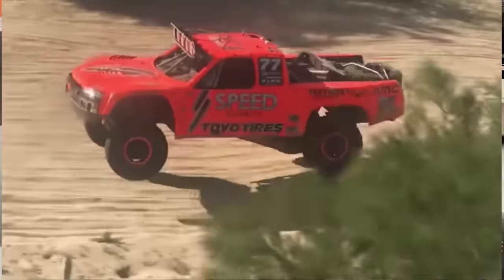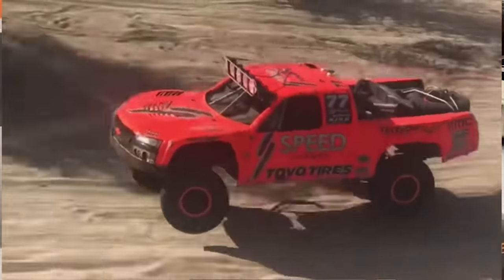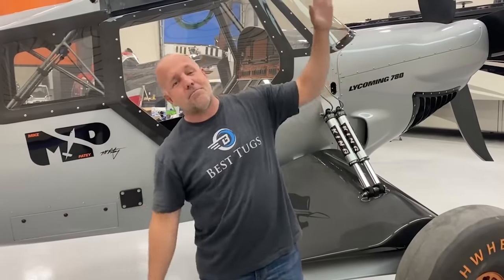On 20 inches of travel, there's a lot of risk with that much travel. And if you set the suspension soft enough to use it, it's going to be fantastic for really rugged ruts and dips or surprises in some tall grass that you couldn't see. The downside is if it's crosswind, you can really get that plane leaning or it can pick up one edge, and so that range of motion can be problematic.